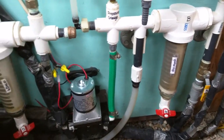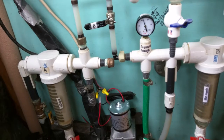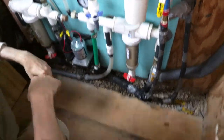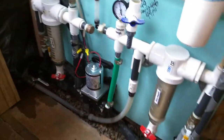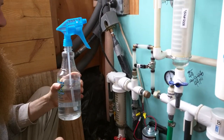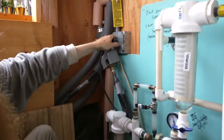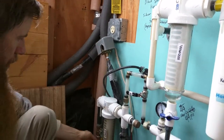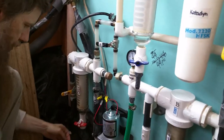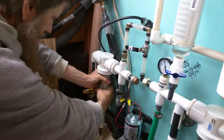So that's the basic system. What we're going to do now is clean the 60 mesh filter and the 500 mesh filter and then work out the procedure to prime the pump. The first thing I'm going to do is unplug the pump, close number one here to isolate the cistern from the system, and start with the 60 mesh — open that up. Very nice.